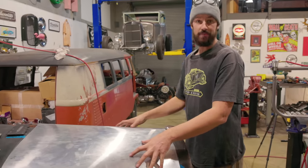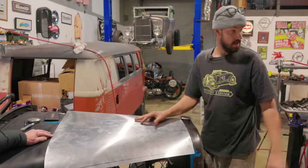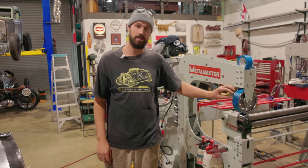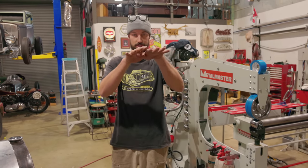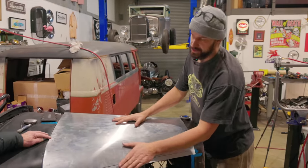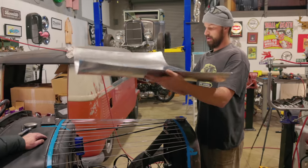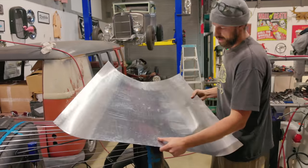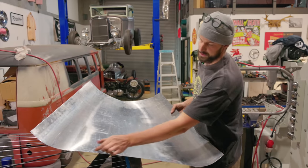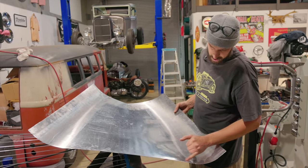So Ben and I have just been on the wheel. We've run it through a few times, changing the die as we go. I do have tape on that upper wheel, so we are getting a two-dimensional shape, not a three-dimensional shape, because that's all we're trying to get, just a little bit of that initial curve. What happens too is I counted my tracks, then we're all having chats here and forgot about them. On the inside here, when we were running our initial 36 radius, I didn't run it right off. So this area has all these wheel track marks where they've stopped along here.